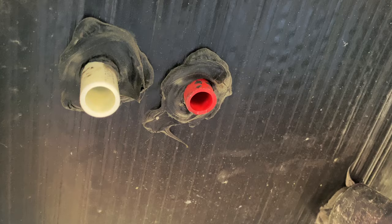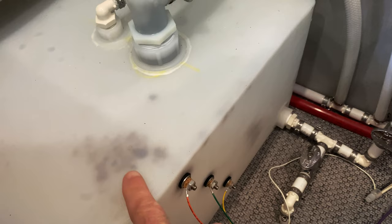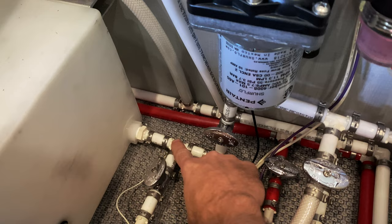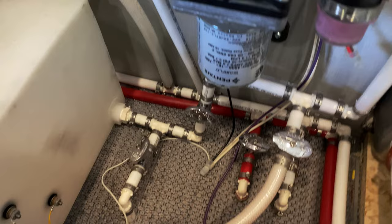When I started doing this, I could hear water coming into the wet/dry vac and running through that line. Apparently, not all the water had drained out of the water tank — specifically maybe not from the bottom of the tank — and that's why the condensation was still present. We've got air coming in through the overflow, and we're trying to suck any water out down through this pipe. One valve is on, one is off, which goes through the water pump.